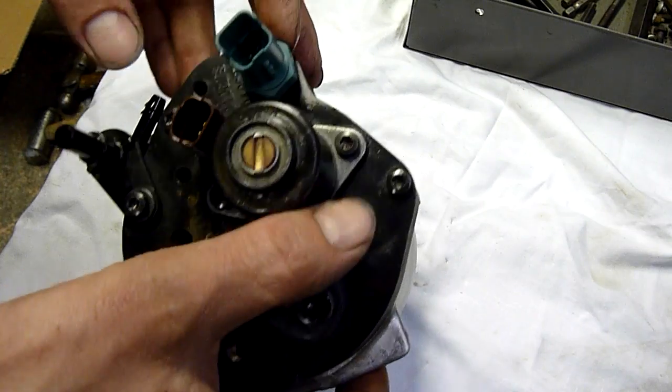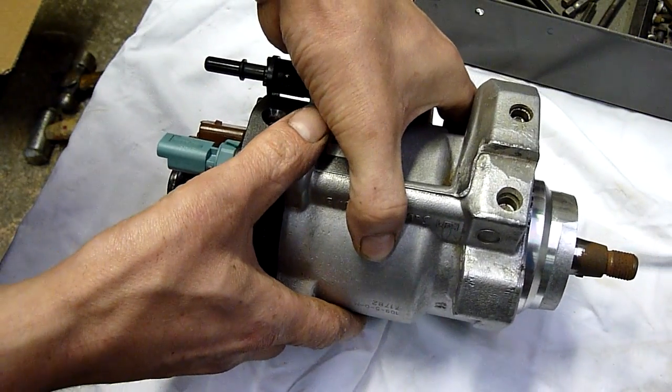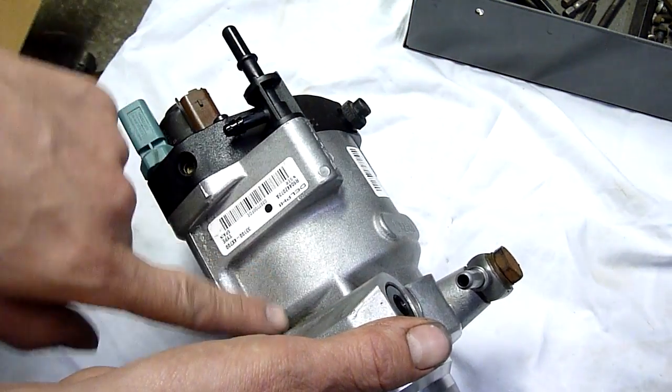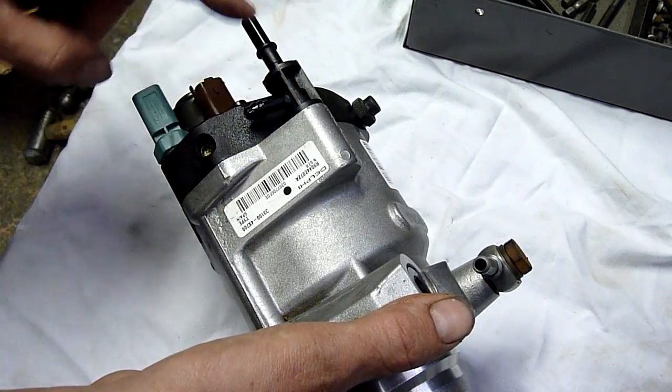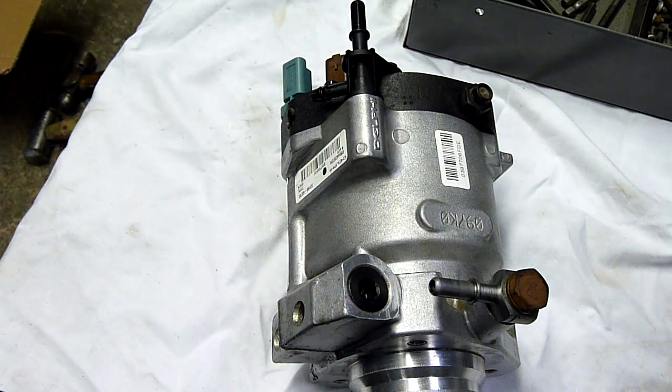I believe that's probably a pressure transducer for the high side, and that'll be a pressure transducer for the low side, maybe to tell if there's an inlet obstruction or the filter's blocked, because low pressure must come into the body of the pump here and also up to here. Looks like a spill return line. Interesting stuff.